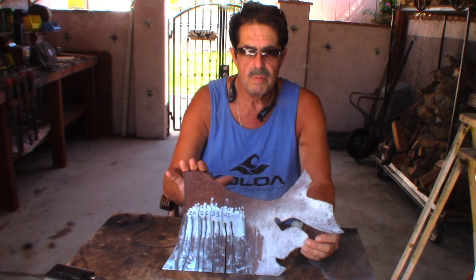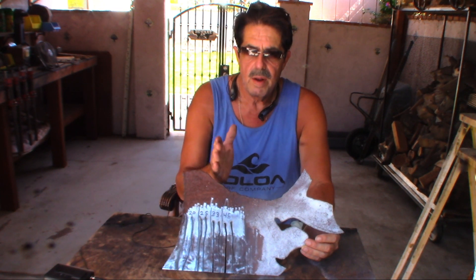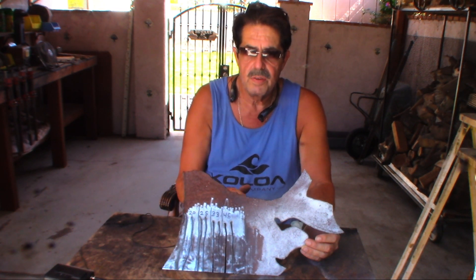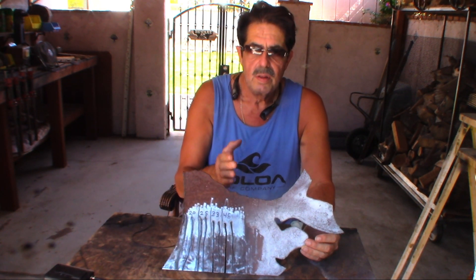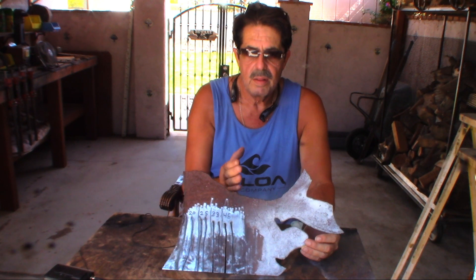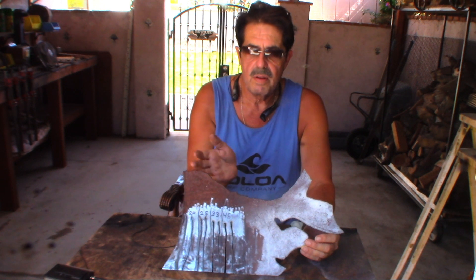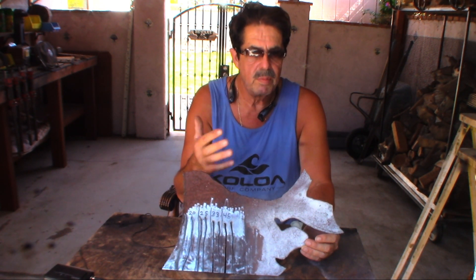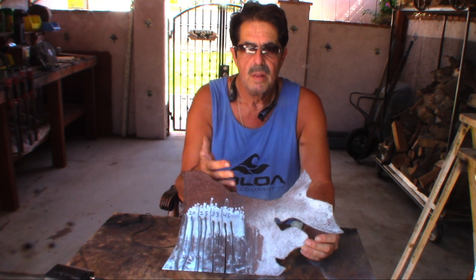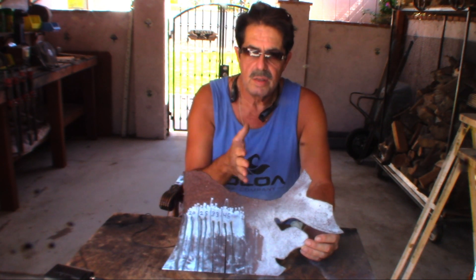You'll learn from doing this. I did those first cuts at 95 PSI, then I came back right between 110 and 115 PSI and repeated those cuts. Now when you get past 33 amps — that's the 100% duty cycle part — and you start hitting 40, 45, or anywhere in between, you've got to give the machine a little bit of a rest to catch up, or you could end up tripping a breaker or the unit can just pause on you.